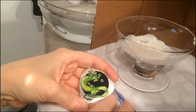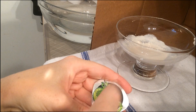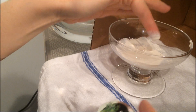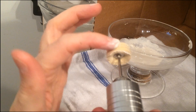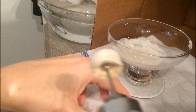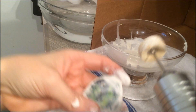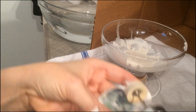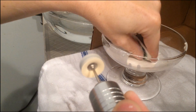Super Cerium comes in a powder form, and you always, always, always want to wear your respirator. I'm wearing one right now because even when I do the videos, this stuff is stuff you don't want in your lungs. I've put it in a little bowl and mixed it with some water so it's a paste. Then I have my handy rotary tool with a chamois — a little leather wheel. I'm just going to dip the whole thing in because we really want to get a high polish on this thing. I have a box back here to keep it from going everywhere, and I just keep it wet.